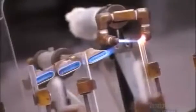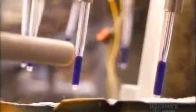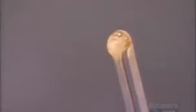As the tubing turns, flames follow the top end to melt and close it. A heat gun below then drives the liquid up the tubing, and the air pressure creates a bubble in the end that was just closed. This bubble will be the thermometer's expansion chamber.